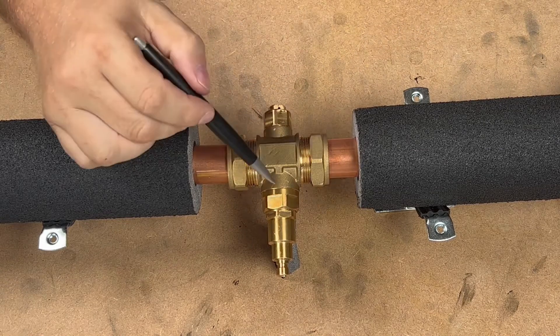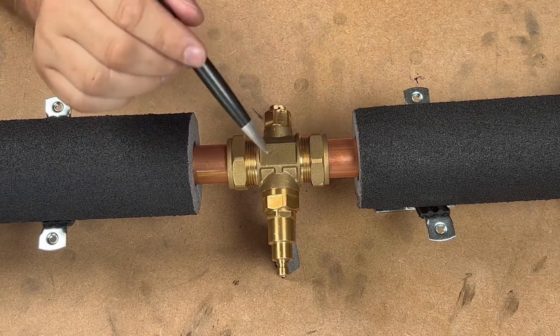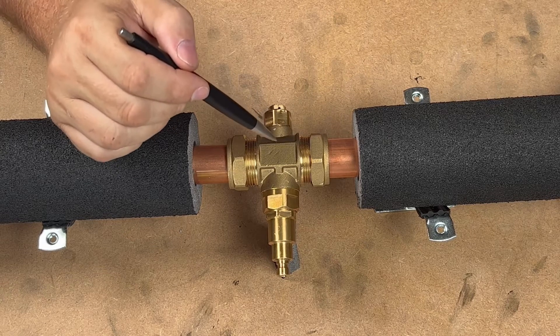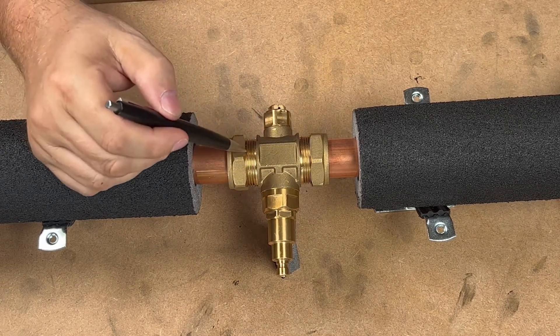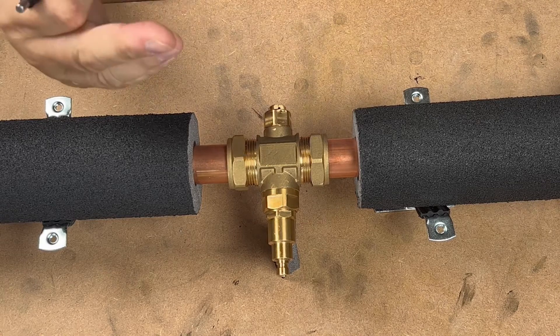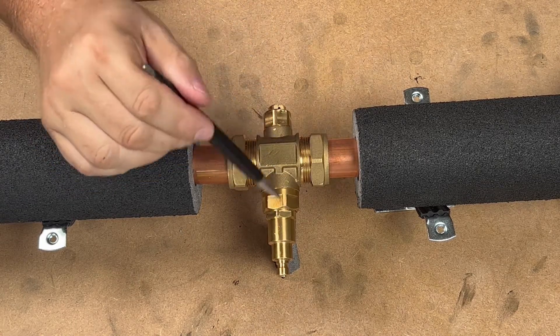It's really important to insulate all this for two reasons. One is to reduce any heat loss and the other is to slow down the temperature loss if there is ever a power cut. So we're slowing down the temperature — say it's a return at 40 degrees — giving us a lot more time for power to be restored so the antifreeze valve doesn't have to blow off.